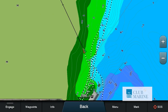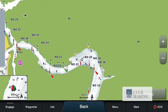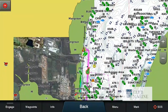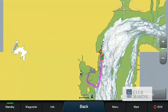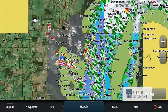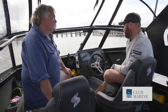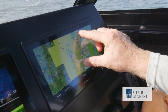You can pull up a route and using your autopilot the whole boat will basically steer itself. I could be offshore at Cape Schanck, choose a waypoint or the end of the five-knot zone in Hastings, press Auto Guidance, and it'll choose a route away from any obstructions — not a straight route, but an actual safe route you can adjust if you're not happy with it. That's important in Hastings with the snaking channel. With a deep-draft vessel, you can program nine foot of draft into the unit and it'll map outside of that and give you shallow water alarms and waypoint arrival alarms.